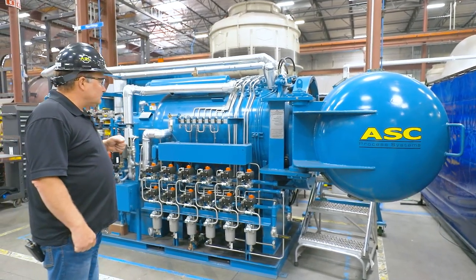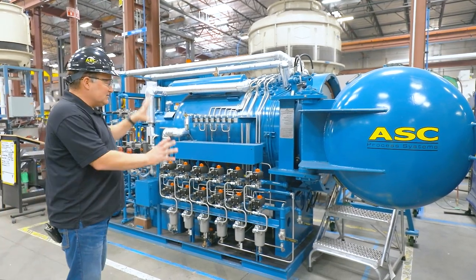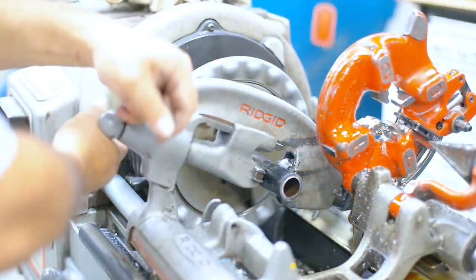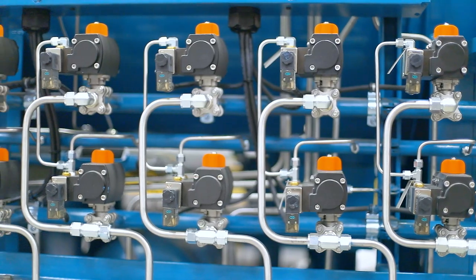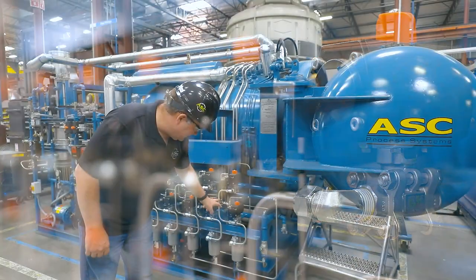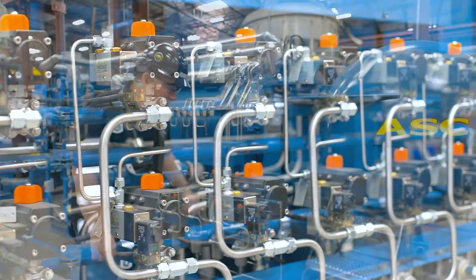What you see here is the pressure vessel, and you also see a lot of stuff on the side — this is all plumbing as we see it. You're going to learn to cut pipe, thread pipe, and assemble fittings onto pipes. These down here are what are actually called vacuum headers — this is the vacuum system of the autoclave. You'll see we're using valves with tubing here; this is stainless steel tubing, which is also considered part of the plumbing.